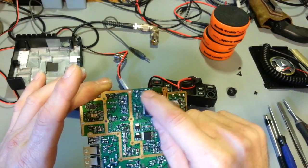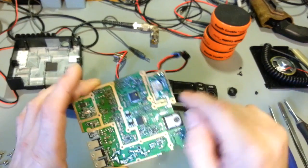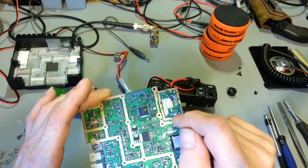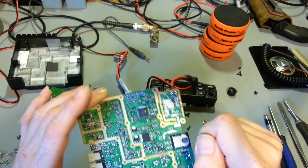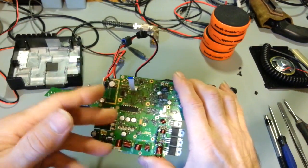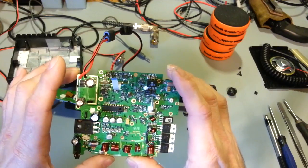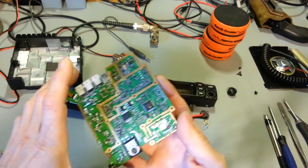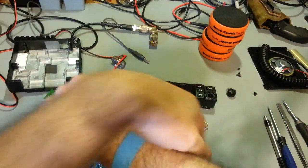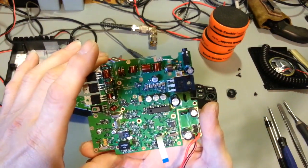There is one area here with a lot of solder pads but no components - looks like room for an 8-pin flat pack IC and other components, possibly resistors and capacitors for another application or version. Other than that one little area, unlike most export radios that commonly have only half the holes filled, this board looks very populated. The MCU is right here controlling everything. Take proper ESD precautions - anti-static strap and mat - when working on this kind of stuff.